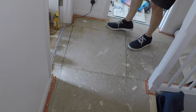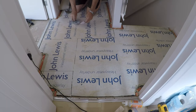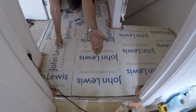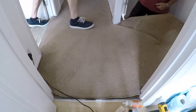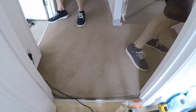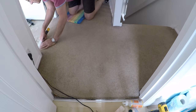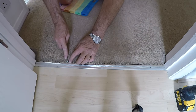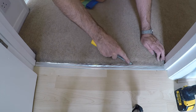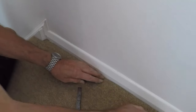This one I just screwed — I haven't glued it — and the same goes for this L-shaped piece. All I've got to do now is put the paper felt back and then the carpet. It was originally stapled, but I didn't have my stapler, so I went out and bought some 15mm clout nails — they'll do the job. Ideally you'd use a carpet stretcher, but with such a small area I found that shuffling the carpet back into place with my feet worked just as well. Finish off by tucking the edges onto the grippers — you can buy a carpet tucking tool, but I've always found a chisel, flat-blade screwdriver, or even a small paint scraper works just as well.